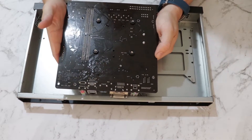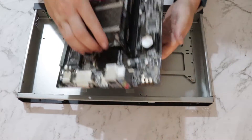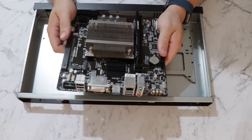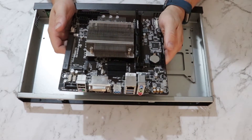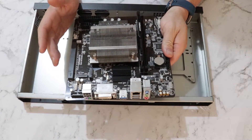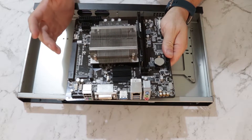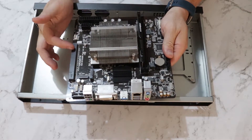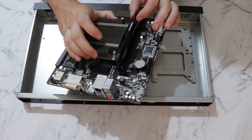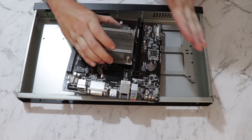On the underside there's nothing fancy — just a couple of makeshift nuts to hold on a Supermicro 1U CPU cooler, which is a passive cooler. This is why we need to direct airflow at it. I currently have a Pentium G4500 in here, but depending on BIOS support I may try putting in my i7-7700T, which is a quad-core, 8-thread, 35W processor. There's a stick of HyperX memory in here but it's too tall for the case — the top panel bows out.